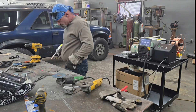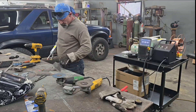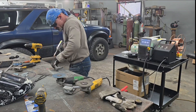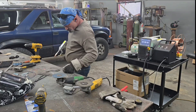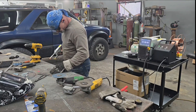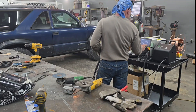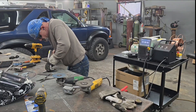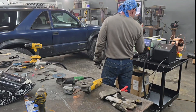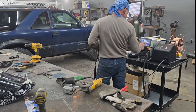Back here with the laser getting this thing welded together. Assembling this with the laser welder, I had the heat wide open and the thing I kept adjusting was the wire speed, so I fiddled with that a little bit. As far as gas, I'm using a mixed gas — a steel mix like 75 argon / 25 CO2. In other videos I've watched, guys would use pure gases like pure argon or pure nitrogen, and that might be better for the laser. The only difference it's probably going to make is in the appearance of the weld — I may get a slightly dingier look because my gas contains CO2.